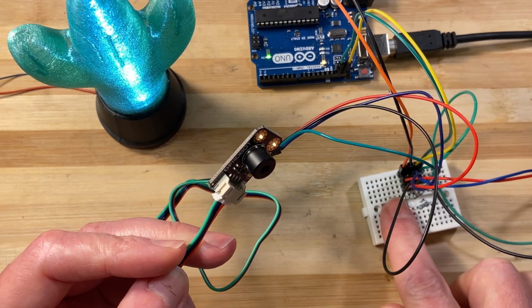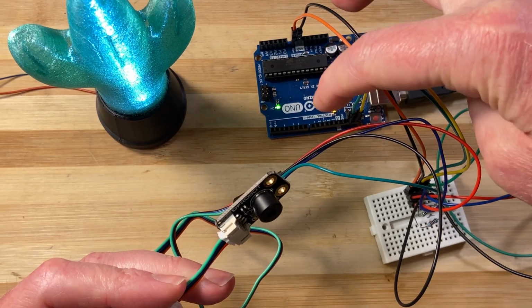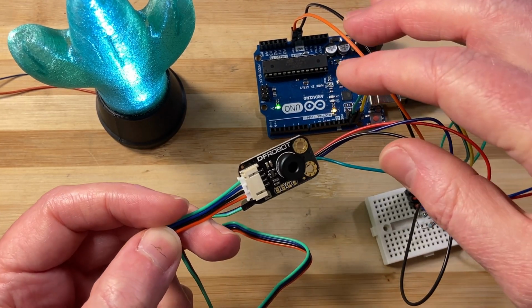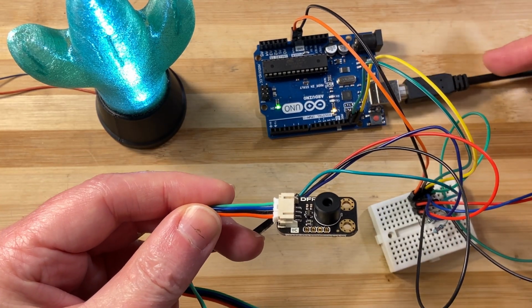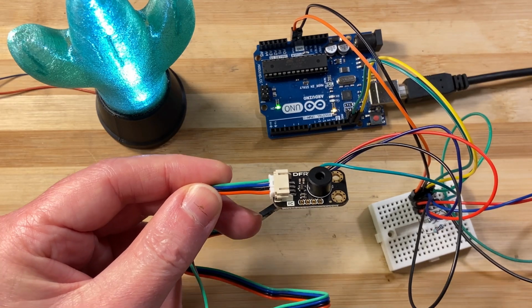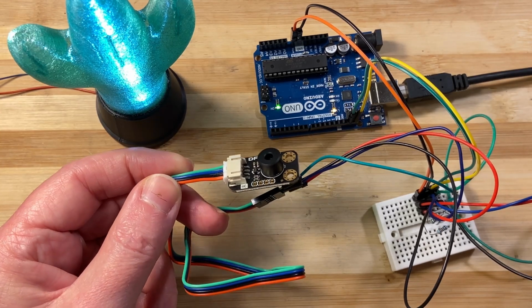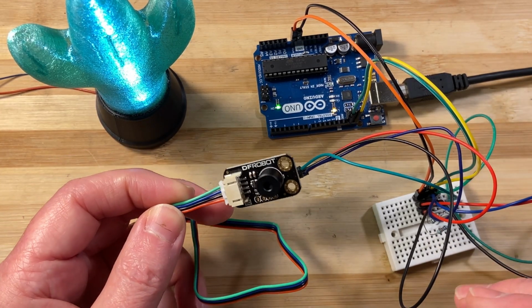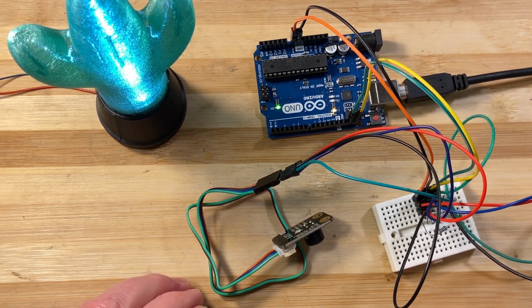So what I've got it connected to is I2C lines, going into my Arduino Uno over here, and it reports the temperature over serial to the sketch or whatever other interface you might have connected to it. So that's the sensor. Now it's wired up. Pretty simple stuff. Next I'll show you what it looks like on the PC software, and then we'll wrap this one up. It's a quick one. See you at the PC.